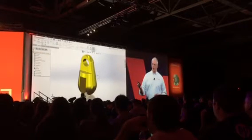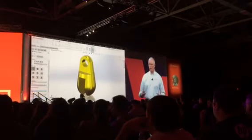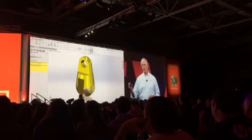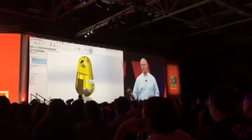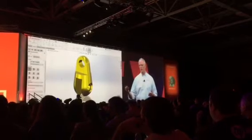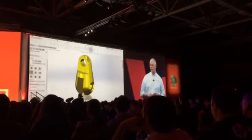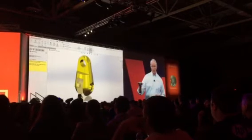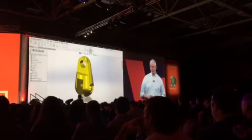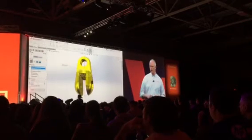Next one we're going to do is add the holes at the bottom. So there's a counterbore hole on the right side and a tapped hole on the other side. What we did here is we're just going to place an M10 button head counterbore hole, and we're going to do this by placing it onto the 3D surface. You do not need to create a plane to create that. With the Hole Wizard, we allow you to place holes onto non-planar surfaces. I think it's really important that people understand how to do that. And in that hole, what I did is I added a along X relationship to establish that position. This one's just placed on a planar face, a tapped hole, and that's going to be an M10 tapped hole.